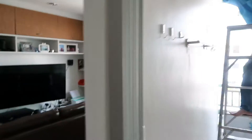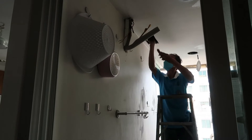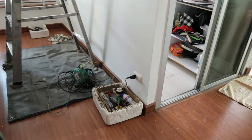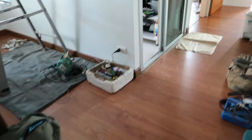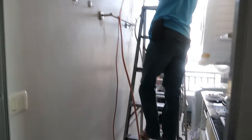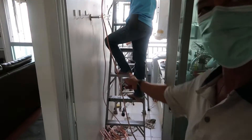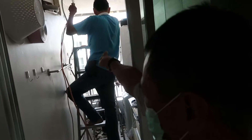It's flexible copper tubing with steel armor protection. That's the new copper tubes now threaded through the ceiling from the evaporator, turning the corner to where the compressor is going. The compressor is still here — they'll get it tubed in first, then move it to its location.